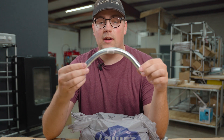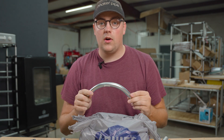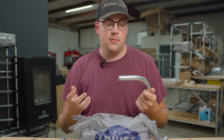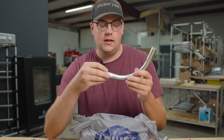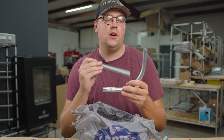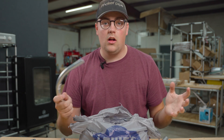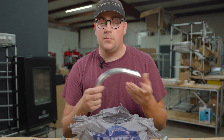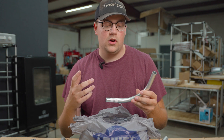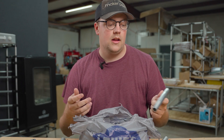This is an interesting one — a pre-bent 90 that you can buy off the shelf. It's a very short stub of conduit that's pre-bent for you. You can bend conduit pretty easily, but if you can't make the bend or need a pre-bent 90, you would connect it with your conduit using a coupling and continue your run, making a 90-degree turn that's already pre-bent. These are available in pretty much all of the off-the-shelf conduit sizes and work great for making conduit bends — people even use them in DIY builds with Maker Pipe's connector system.